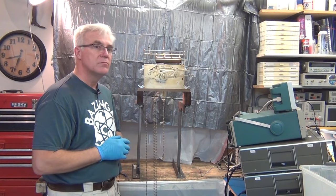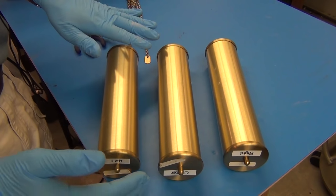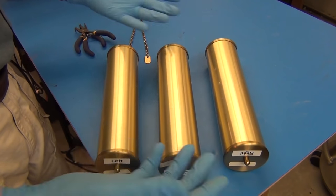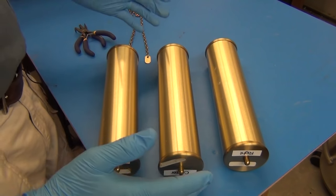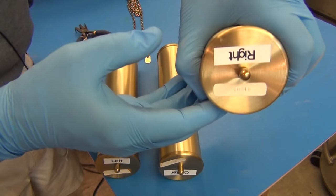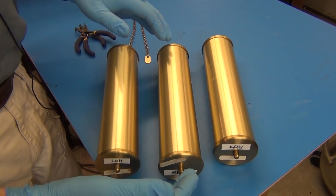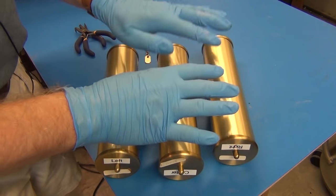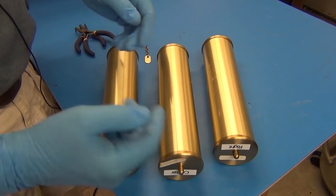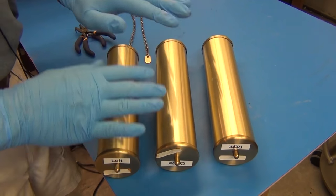So let's go to the bench. These are the weights — you would start with them actually in your clock. They come labeled; as you can see I have really old labels on mine, and I updated them with a printer on the bottom. Make sure you wear gloves when working on your clock — most people use cotton gloves but I like neoprene. Don't mix the weights up because they are different weights.